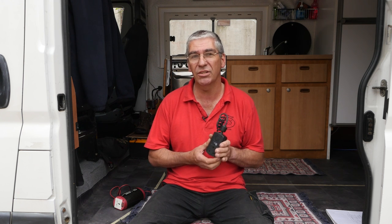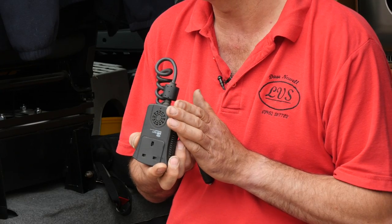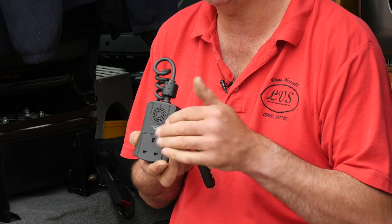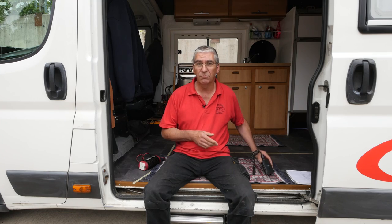The other thing to bear in mind is that you lose energy with an inverter — the inverter itself takes power to run. So that does 120 watts, it will probably consume 150 because of the power it needs to run itself. Very useful tool, but consider whether you really need one or not.